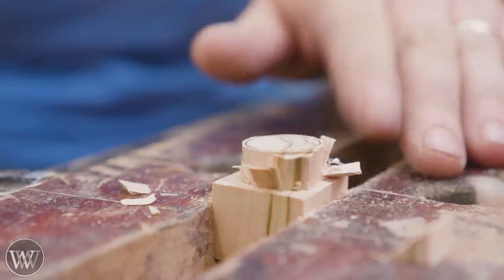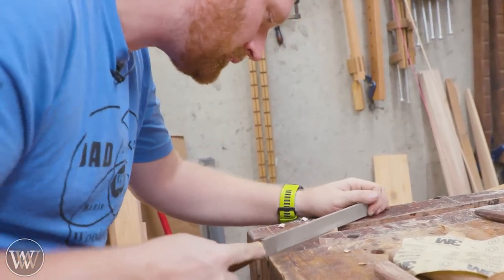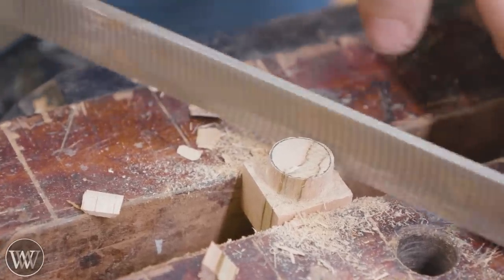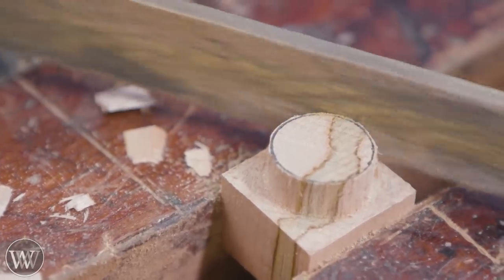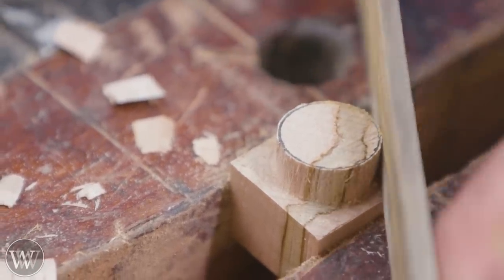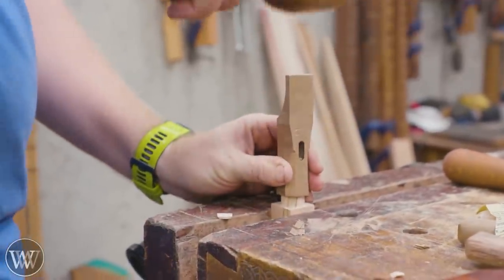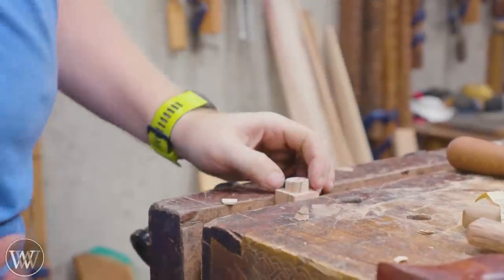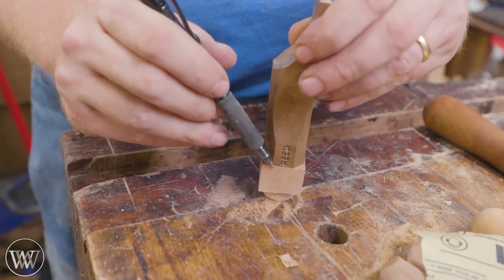This is spalted hard maple - really, really nice wood for this, and the matching handle is made out of the same thing. We can come in with the files and floats the exact same way we did before and round it down. I want to get it really close to that line, but ever so slightly larger - I want it so that this doesn't quite fit into the head. I want it to almost fit - just feels like if I really pound it down on there it would drive in, really close but very snug. You can see how it's bruising the side there - that's what I want.